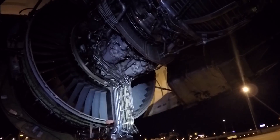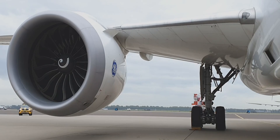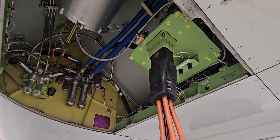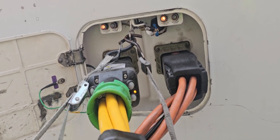In this video I will primarily focus on engine starting with the aft external power. Because the 787 has a bleedless engine, the engines are started electrically. Because the engine electrical starters use so much power on startup from the two external powers, a third external power is connected to minimize the load shedding in the whole airplane.